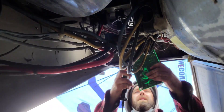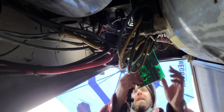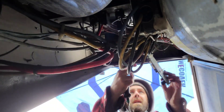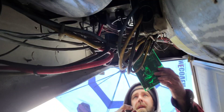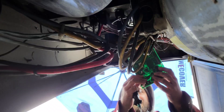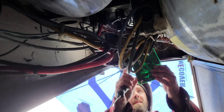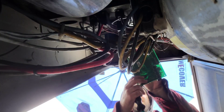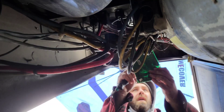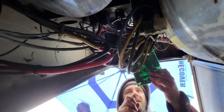So I took this board right off and just took all the Molex plugs out and all of the connection points on the thermostat. I pulled the board right off, put the new one on, and then I go wire for wire on the thermostat stuff. The Molex plugs are really easy because they're right in the place they need to be and you can't really screw those up, but you really need to be careful on these thermostat wires. This building is quite old, and about three or four of the thermostat wires are black, so that's why you've got to be careful here.